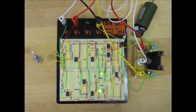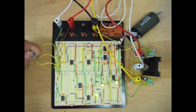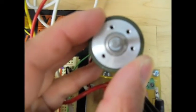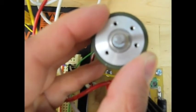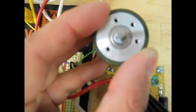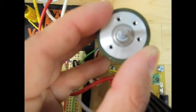And then from there, it goes into an OPA511, which is a voltage to current amplifier, which has another gain of 1/2 amp per volt, which then leads right into the motor. After the voltage to current amplifier, the system feeds right into the motor and tachometer. The tachometer will spin the motor at 1000 RPM for every 0.52 volts going into it. So between our potentiometer feeding negative 2.5 to positive 2.5 volts, we could get anywhere between negative 5000 RPM to positive 5000 RPM on the motor itself.